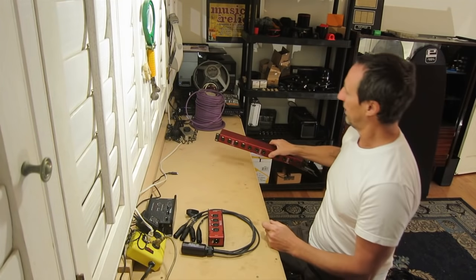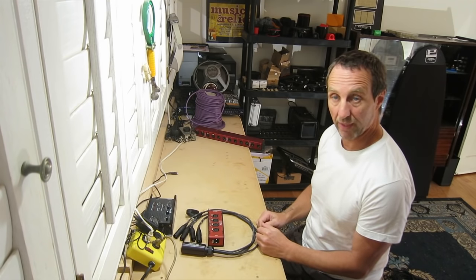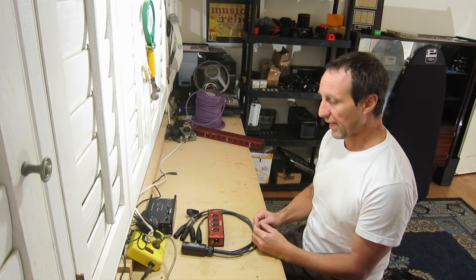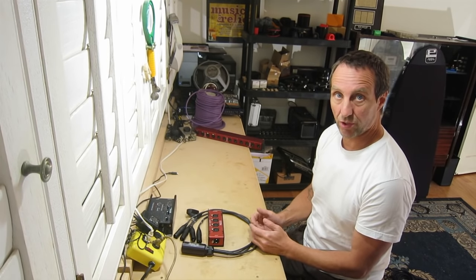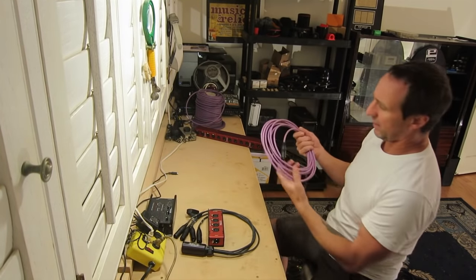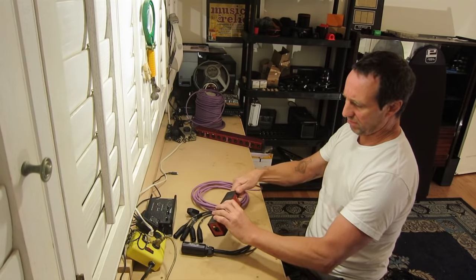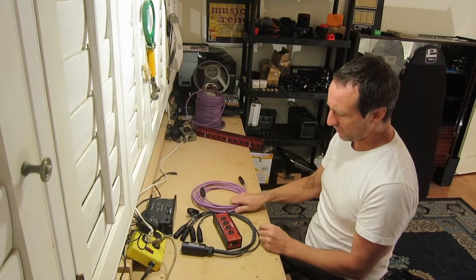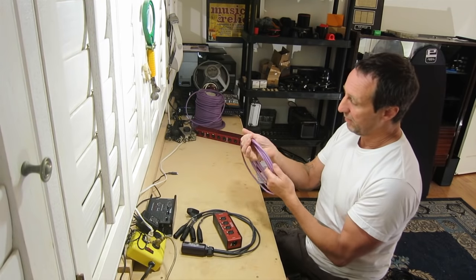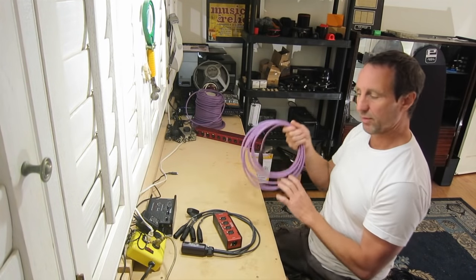I did a video on cable lengths showing that Cat5 cable's good at transmitting AES EBU over long lengths. Digital audio is very high frequency, and Cat cable is a commodity. It's very inexpensive, and it's actually cheaper than audio cable. We make some quality Ethercon cables, and you can actually have multi-pins with disconnects for a much lower price, much thinner, lighter, easier to carry, and it carries AES farther than conventional audio cable, so it's kind of a cool solution.